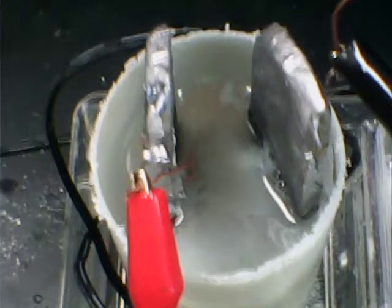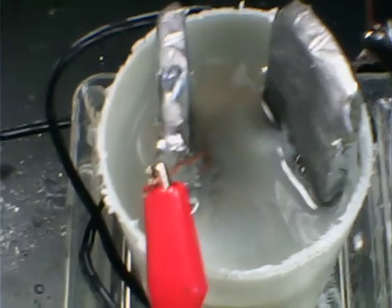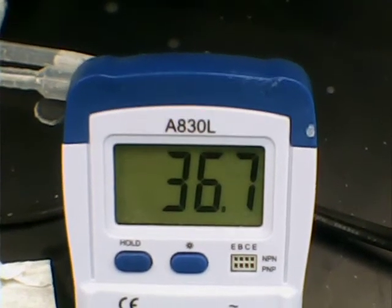Here we see a lead battery that I'm testing with a certain gel electrolyte. I'm short-circuiting it now as part of cycling — I'll bring it down to about 10 milliamps and then recharge again with a power supply. That's simply to prepare the cells.